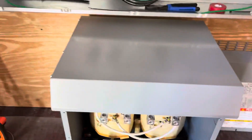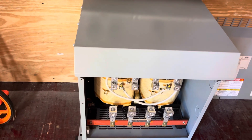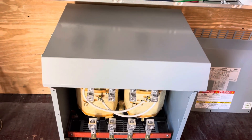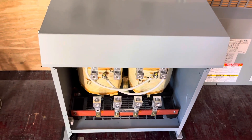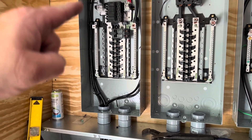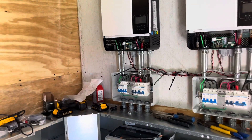I think that's the safest way to get the neutral from these Growatts versus auto transformers, and it will also isolate the neutral from the incoming neutral through the transfer switch. This is what's called a separately derived neutral. Everything coming into the transformer is coming in at 240V, even when the inverter is taking power from the utility input panel.